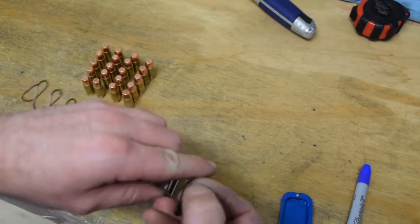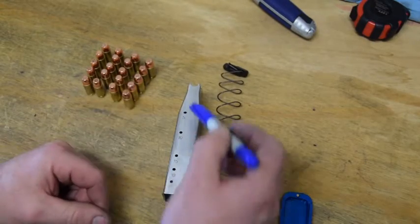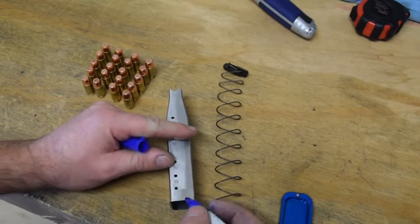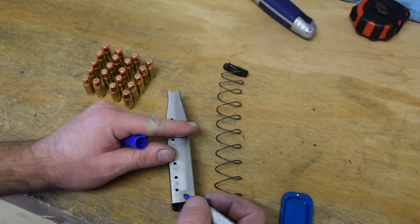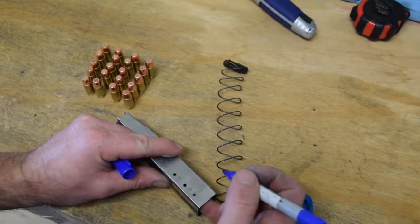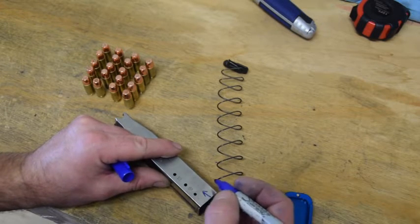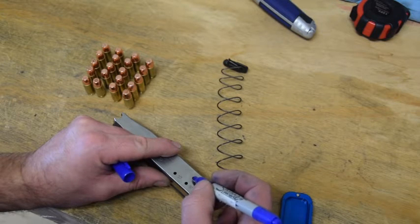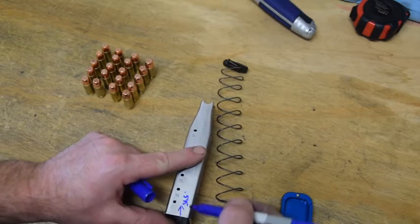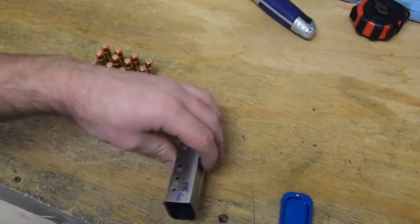I just do that with a Dremel on a wheel — you just take that front corner out. Other than that, you stick it in here. On the STI tubes you'll see witness hole marks up to 18; I think we're going to get 21 in this one. This hole I had to make — you've got to use a really hard drill bit, and once you do you've got to clean out the inside. Just under an eighth-inch size hole, that's .545 from the bottom. Take your calipers, lock them in at 545, put a little dot there, and that's where you drill.